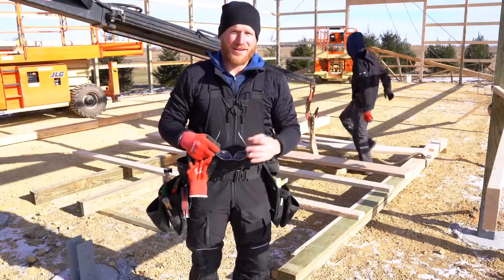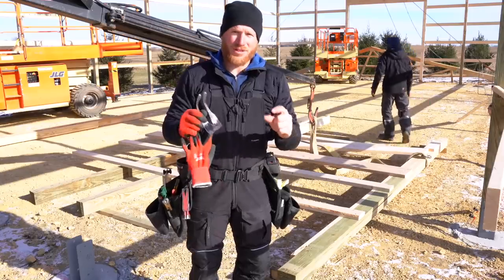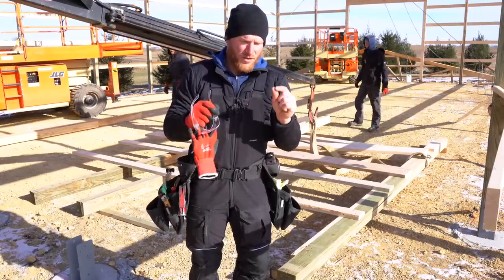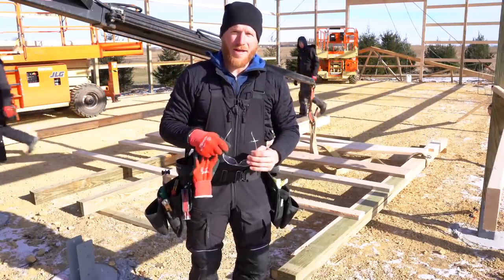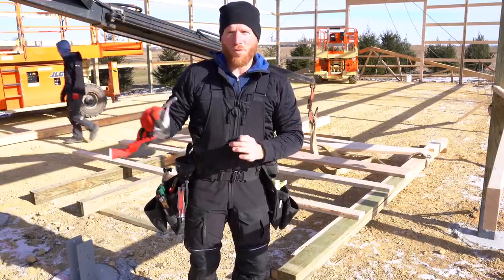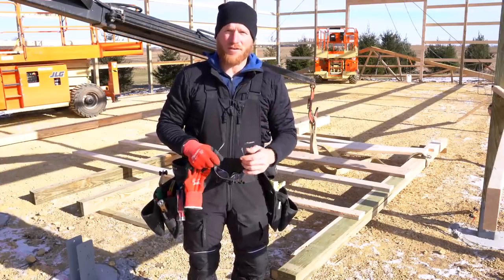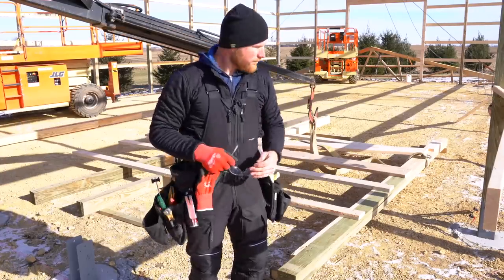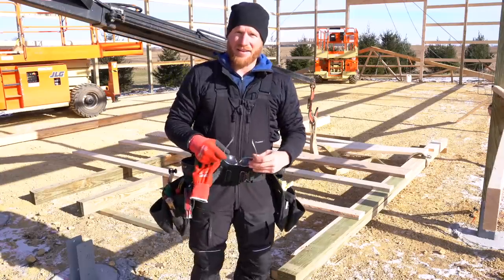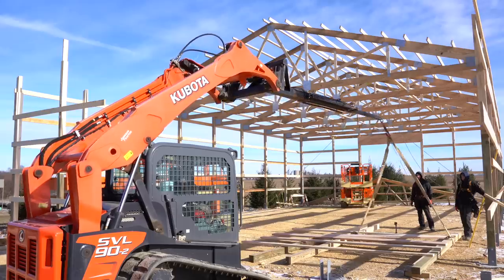super precise. And I think it has a lot to do with the accuracy of those stair knobs, having those little gauges that tell you exactly where you're at. So when I got to dial in a 4/12 pitch cut, I can put one at 4, one at 12. In this case, I went 6/18 because it's still a factor of a 4/12 pitch slope. Gives me exactly perfect mark so I can make really nice cuts.